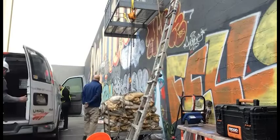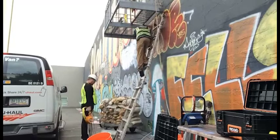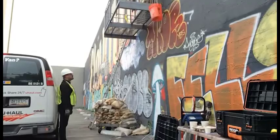And the accordion ladder needs to be dropped and the cables need to be changed. You observe 400 pounds to begin with, measured before, during, and after. Then you observe the full weight of 1,000 pounds, measured before, during, and after. This usually takes about 30 minutes per pull. You can single pull a bracket, or you can single pull two brackets side by side using an aluminum I-beam between the two.